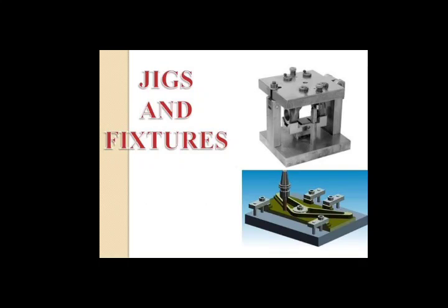When we talk about multiple clamping devices, double clamping is used when it is required to clamp two workpieces with the same variation by a single strap clamp. Equalizer allows variation in the workpiece sizes. It is pivoted around a pin. An even number of workpieces can be clamped by an equalizer.